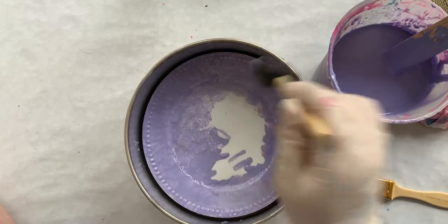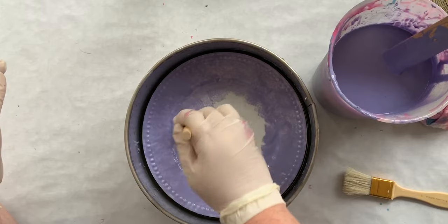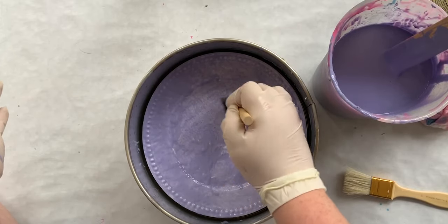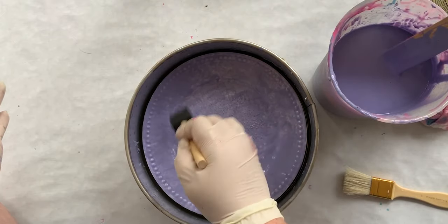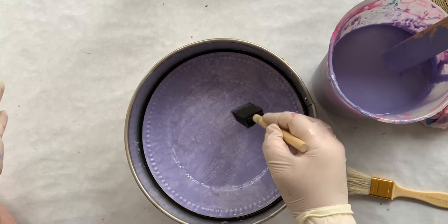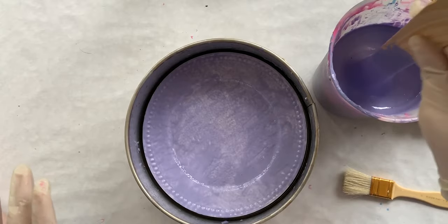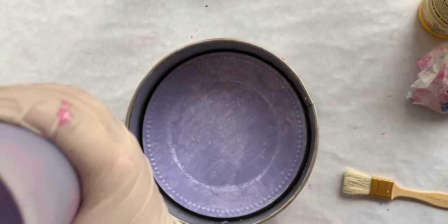Definitely gonna get pouring. So when we pour, we're gonna pour from high up because you want your silicone to hit your plate, whatever you're molding, we're molding a plate, in as thin a stream as possible so that there's as little bubbles as possible. Okay? All right. I think, don't quote me, but I think we're good. So we're going to go ahead and pour, and we're going to pour from high up so it's a thin stream.